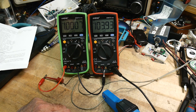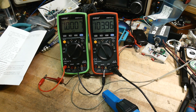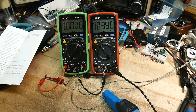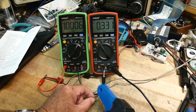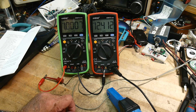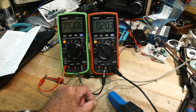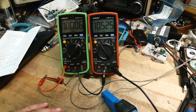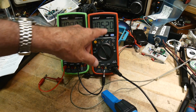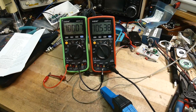We're at about four percent high — this one might be just a tiny bit out of spec. Switching to the other range makes all the numbers smaller. After zeroing on this range and clamping on, we read 105, which is 10.5 millivolts — compared to the 100 millivolts we saw before. That's how the scale factor works on the high range.